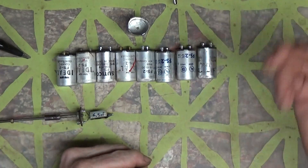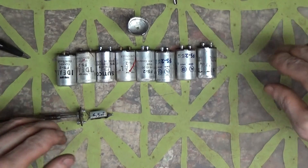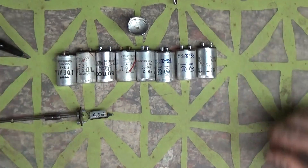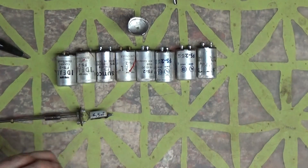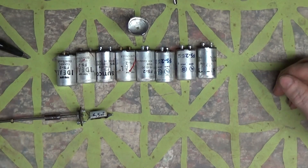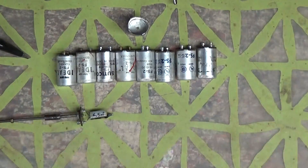When it gets cold out you'll see that fluorescent tubes have a hard time lighting. That's because the temperature is lower and they like to work at a hotter temperature — the gas inside the fluorescent tubes works like that. They even have mercury around the filament too that helps it ignite and gives off the color.